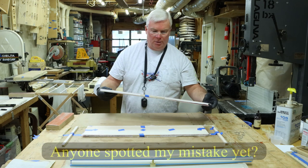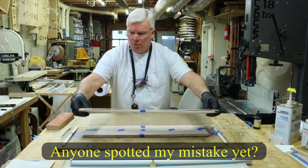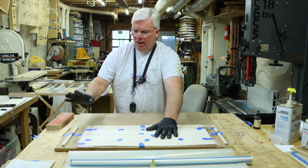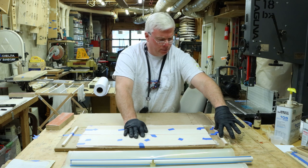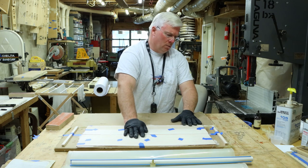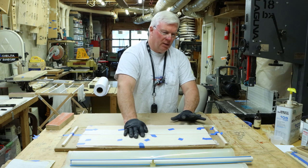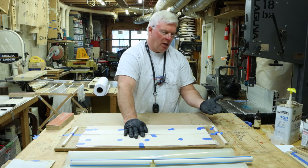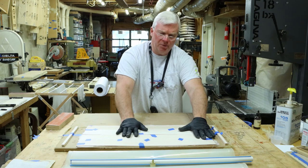All right, so we've got our two pieces taped together, and they look really, really nice. So I've got a piece of, or actually two pieces of scrap MDF here. I have also taken a couple of spacers. I've had to learn this through trial and error. If your vacuum is just a little bit too strong, we'll go about 8 inches of mercury. Between 8 and 9, it'll fluctuate right there. If it happens to sneak up around 10 or 12, it could actually squeeze the ends of these two plenums together, right? Because the foam, there's nothing to keep the foam from squeezing in.